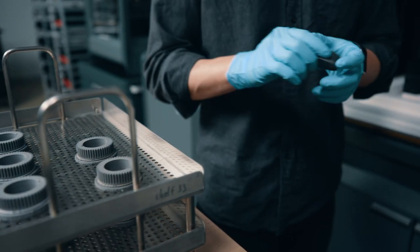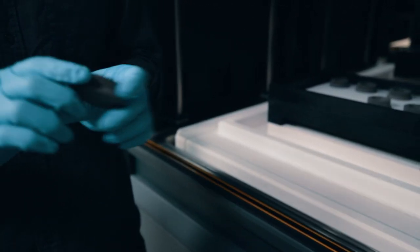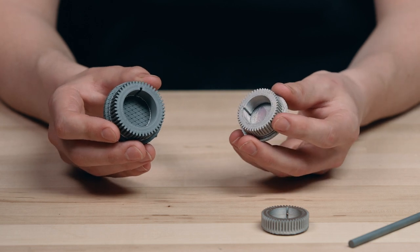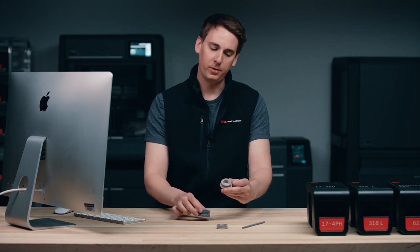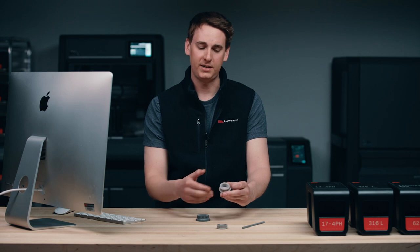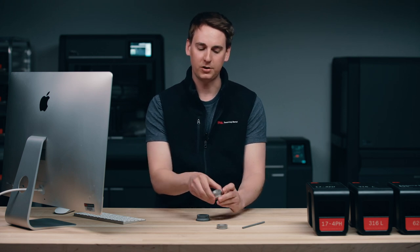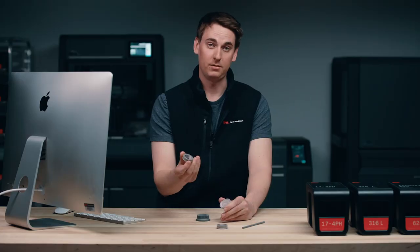With the brown part correctly positioned in the furnace, it will be heated in a sintering cycle, which is fully controlled by Fabricate. During this heating process, the remaining binder is evaporated and the metal particles fuse together. As you can see here, the part is going to shrink by about 15 percent, due to the metal densifying in the furnace. What you're going to end up with is a strong metal part. That ceramic release layer simply turns into this pink dust after sintering, so all I have to do is twist our part and release it from its supports — that makes it super easy.